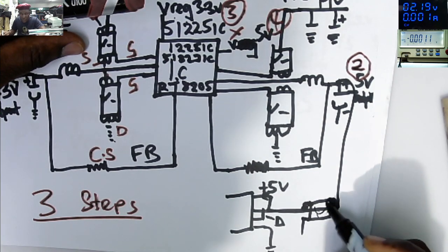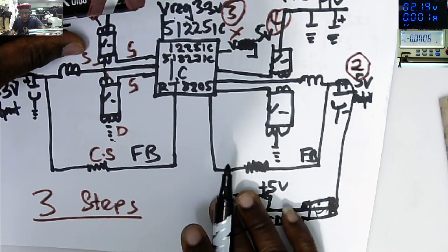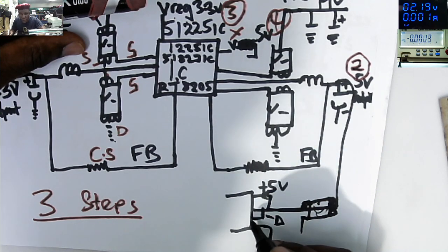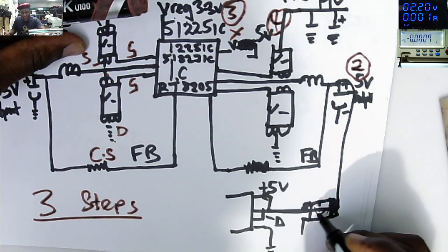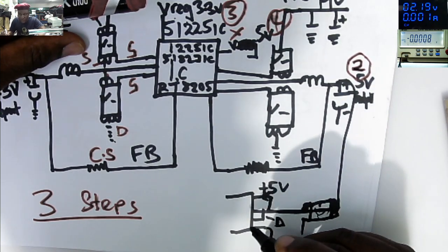What this MOSFET is doing is cutting down the power in line with the short that comes from customers playing with the USB, or if you have any short on the USB, like broken USB, shorted pins. In most cases, you see this chip blown up. It's a small MOSFET, exactly. It's passing 5 volts from the 5 volts power supply to the USB.